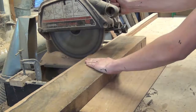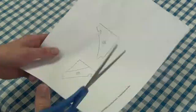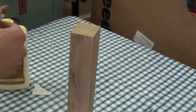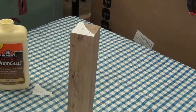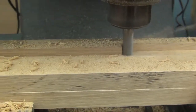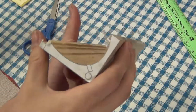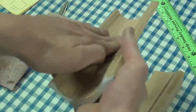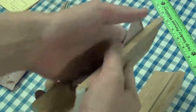After cutting the basic block form of the part, I then cut it and glued a printout of the profile of the part to the end of the block. Somewhat painfully, I milled down as close as I could to the glued profile I put on the block. Literal hours of hand sanding commenced to get the profile smooth into shape.